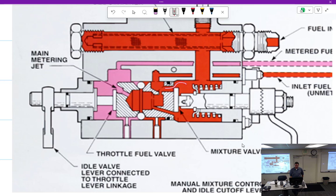Fuel comes around through here into this chamber right here. I don't really know why it's shaped like it is. This red fuel is called unmetered fuel — we haven't metered anything yet. It also comes up through here and goes back to the fuel servo, then out through here into what we call the unmetered fuel in the servo.